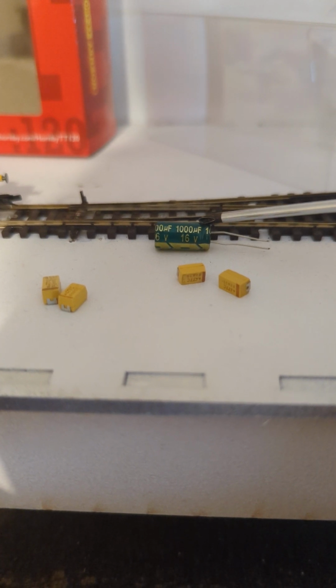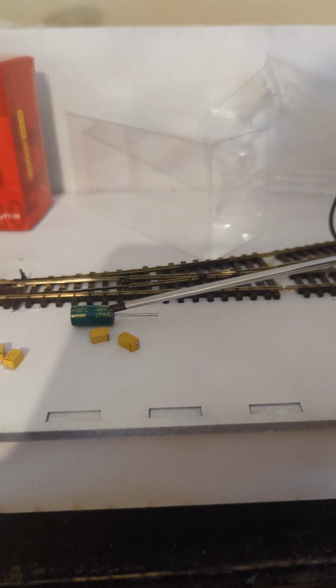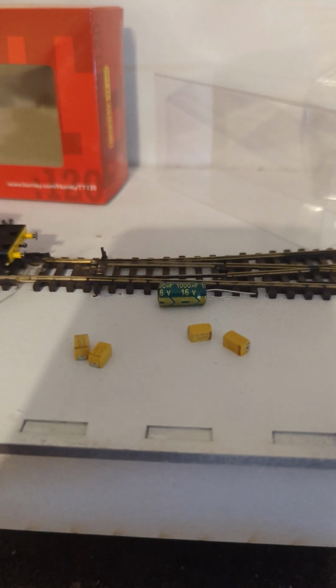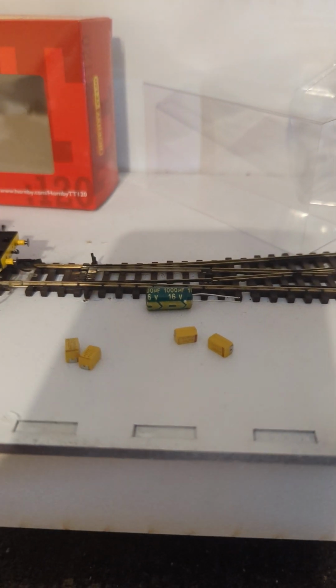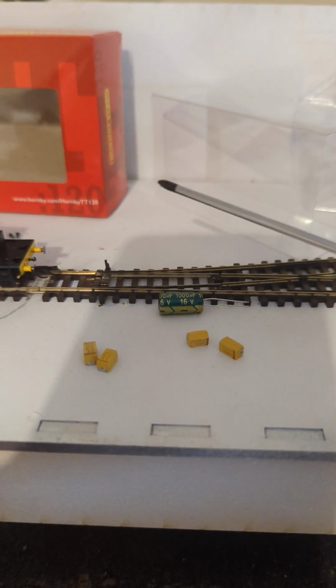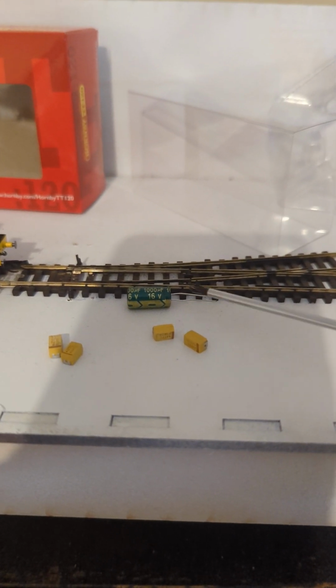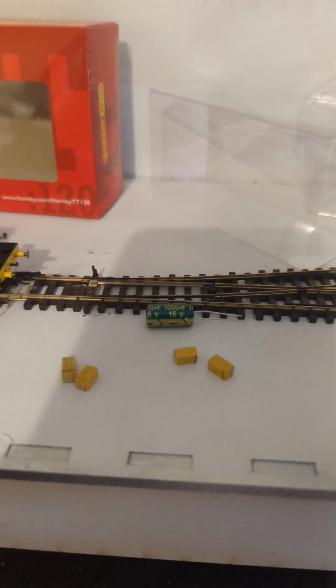But the downside with the tantalum ones is they do go bang, as I've discovered. This one wouldn't have coped a lot better. So it's 16 volts again. You get away with it more on these ones. They're a bit more tolerant of it, but their life will drop. They'll die. But the way that these things die is a bit more of a less dramatic thing. They just kind of stop working, and then they start barfing their internals out, and then they start leaking acid everywhere and destroying everything it comes into contact with. So that's probably not much better anyway.